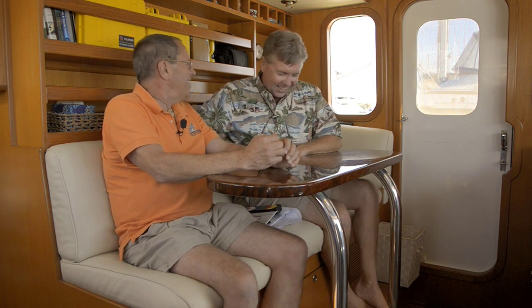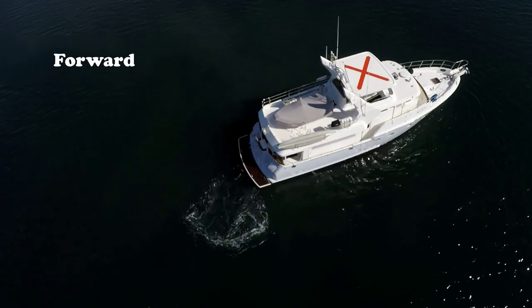When we come back and put it in reverse, that'll stop our forward motion but keep the boat still turning — the prop walk will move the stern around. We do in and out, in and out slowly, and the boat will turn in its own radius. Why don't we just use the thruster? We're learning how to do this with seamanship.